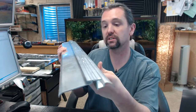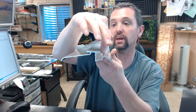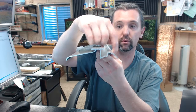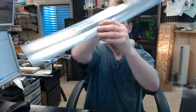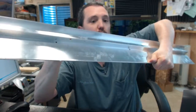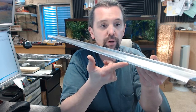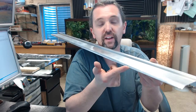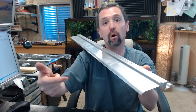What I like about this threshold is its water return principle. You can see there is a trough here, and this is going to be the inside of the door or the inside of the opening — the door typically would swing this way. Any sort of water that would get into this trough is remediated by this hole, drilled through the trough at an angle. Then there is a notch — two of them — in the face of this threshold. That is called a water return. Any water that got in would drain into that hole and out that weep hole.